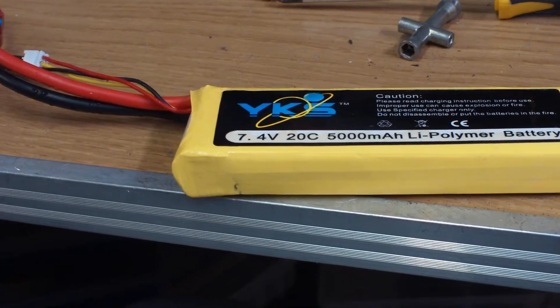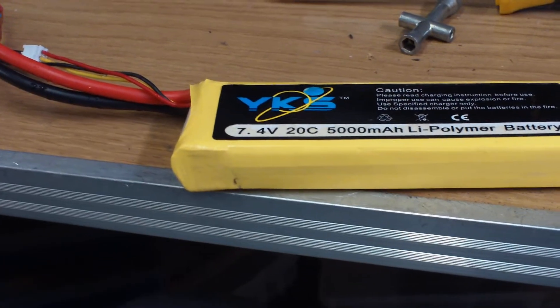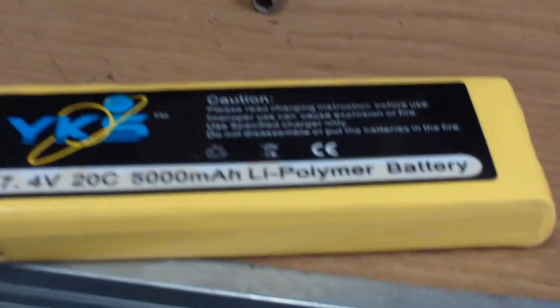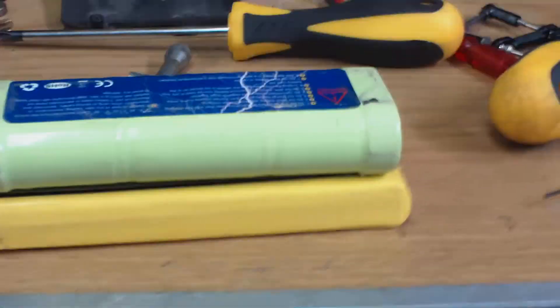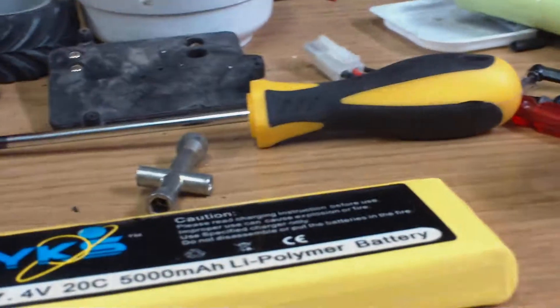With something really low-powered, it wouldn't be too bad. But the main problem I have with it is the fact that I don't know of anything it actually fits. When they say 50 millimeters as the baseline on the width, they're not joking. A normal 6-cell pack is quite a bit skinnier, and it just doesn't fit into the battery compartment on a lot of RC cars. It's also a little bit longer than a standard 6-cell, so you're going to be out of luck trying to fit one without some extensive modifications.